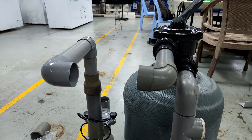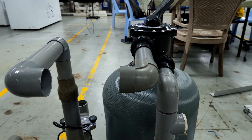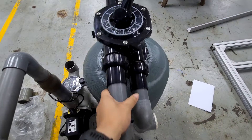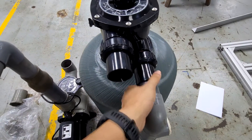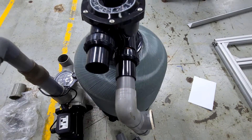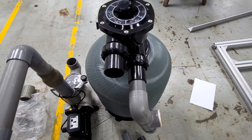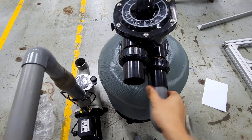You can see that the pump is actually being connected with a one and a half inch pipe going into the left side of the sand filter. And on top of the sand filter, there's this multiport valve. One important characteristic here is that some of the multiport valves on top of the sand filter are actually what we call UPVC, and our normal pipe is actually PVC, so the dimensions might be a bit different.